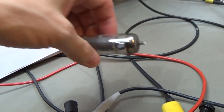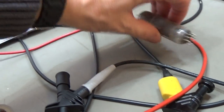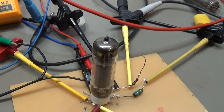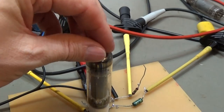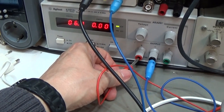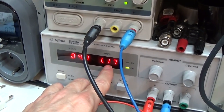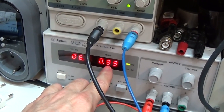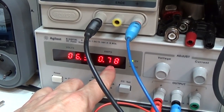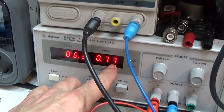Okay, so I have now changed the tubes. These tubes are getting really hot, so I had to wait a little bit until I could grab it. Okay, so our second tube is in. And we do now exactly the same as we did before. First of all, I put back our heating system, and you see a strong current is drawn until the tube is on temperature. And where you see this tube is drawing 770 milliamps, 760.